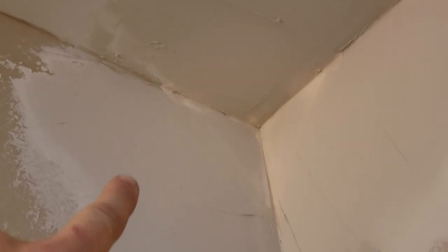Well, the first one didn't end up too bad. It's actually quite a bit easier to make that nice tight corner, but I need to work on feathering a little bit more. It's especially hard when it's got a painted surface to get it to smooth out well. I probably should have put a little more mud on that corner, and I need to use a wider knife, I think that would help. But it certainly did make it quite a bit easier. I have a little sanding to do and probably a light second coat to fix some little imperfections, but I think the whole idea of it works really well.